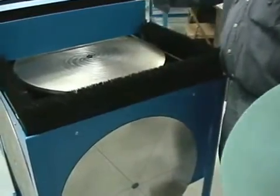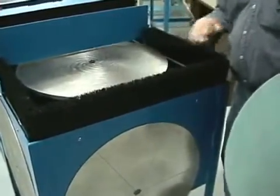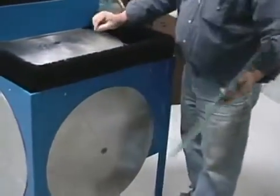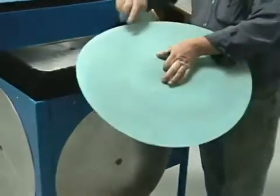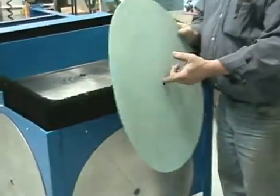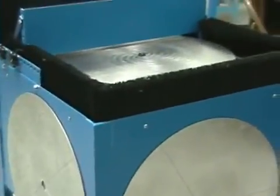And then when you're done with it, at the end of the day, put a light coat of oil on it. You know, pads, like I said, we want to keep them good and clean in the back when you put them on. You don't want any glass or a little sand pebble or anything. Anything that goes on there will wear a spot and it can ruin your pads. We don't recommend it. And then when you're not using it, make sure you take your pads off, and then you put them away nice and flat.